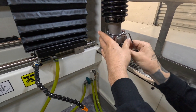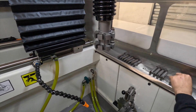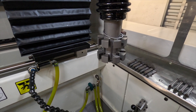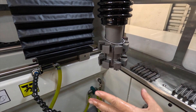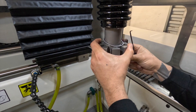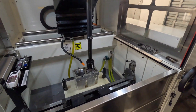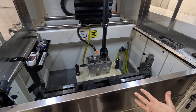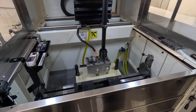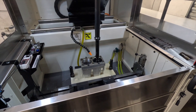Eventually we'll get a new second hone head that we'll have our finish stones in — this hone head is about six grand, so not right yet. So now these are our finish stones. This isn't done by size or stock removal; it's done by time and load — about ten minutes — because all we want to do is knock the peak off the surface.